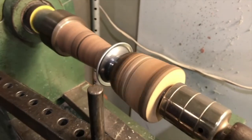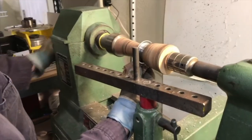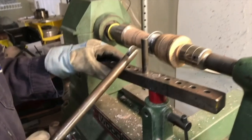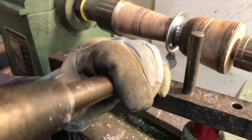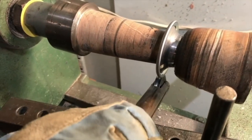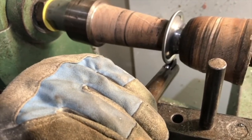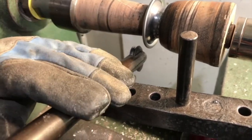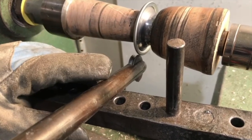One other tool that can work — let me lubricate this again. A lot of these tools come from production shops where speed is really essential. Here you have a rotating wheel with a groove in it: once the edge is starting to bend and fold back on itself, you lever this in and use the tool rest as a fulcrum to push force into it, compacting the rolled edge. You can angle it slightly either way to control the shape.